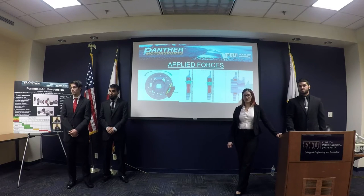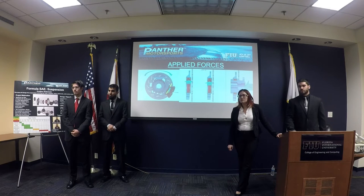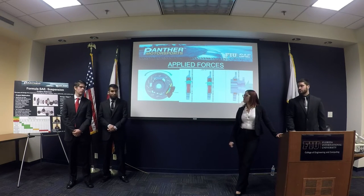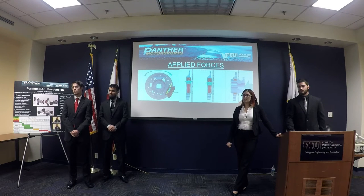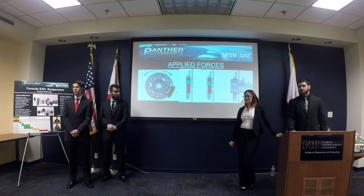Yeah, my biggest concern is you can't answer me what torque you're going to torque your screw at. What bolt? What torque rating you're going to put your screw at. And that's like a very straightforward hangback. Like you're talking about for like the control arms? Yeah, for anything. You can tell me that size 8 bolt will be torqued at 50 inch pounds, 100 inch pounds, 200 inch pounds, 100 foot pounds. That doesn't mean anything to you, and that's super crucial to the integrity of your mechanical system.